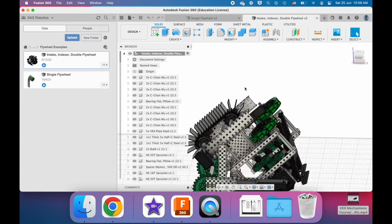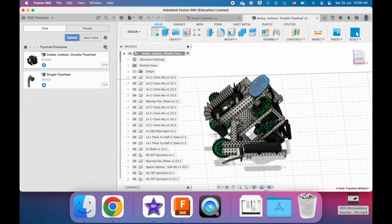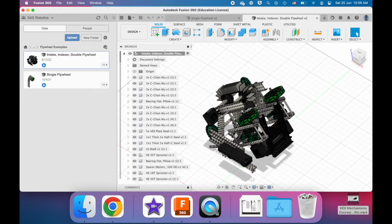And in this case, in a double flywheel, if you spin both of these wheels at the same speed to maximize the trajectory, you're not creating any ball spin. And why ball spin is important is that it usually increases the accuracy of shots. Just something that you can go try out. Grab a basketball, try tossing it to your friend without any spin. I'm sure you'll be able to do it, but then maybe take a step backwards and do it from a farther distance, and try doing it with a spin and see which shot's more accurate. It's just a natural physics phenomenon. When you have spin on your shot, it is usually more accurate.